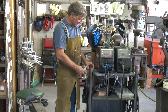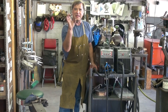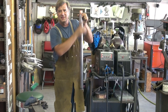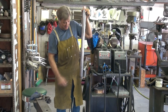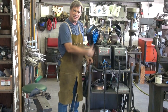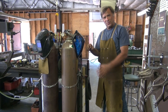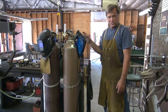You've got to have some place to store the rod for the TIG. So this is just 2-inch inside diameter steel pipe that I cut little rings off of and welded those on. Then I've got some 2-inch diameter outside stock — polished it up a little, cleaned it up so it's a little under 2-inch now — and welded a little cap in the bottom of it. Now it just sits here, one size on one side, different size on the other. I've got four extra rings on the back of the cart, two on each side, so if I want to put some aluminum or some stainless on here, I've got the rods I'd normally use without having to go back to the tool room to find them.